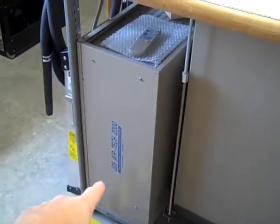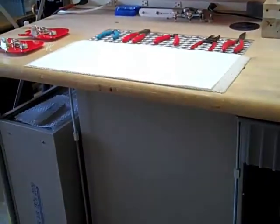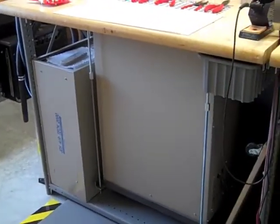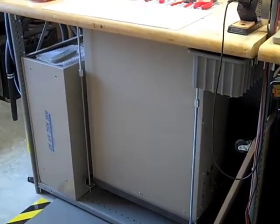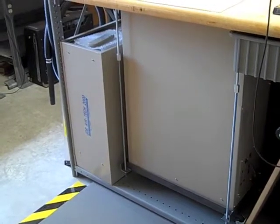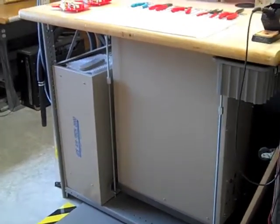We spent seven or eight hundred bucks on that system and it just proved unsatisfactory. So what we finally did is this: we bought these JDS filters, basically for filtering dust in a woodworking shop — they hang from the ceiling. I called them up and asked if they'd work for removing smoke. The rep said yes, if you had the right filter — a 98% DOP filter — because smoke particles are really small, down about 0.3 microns, which is about the size of a virus. Most filters won't filter smoke, but a 98% DOP filter will work.